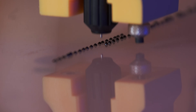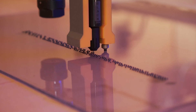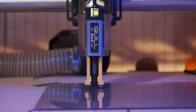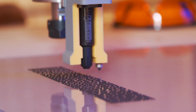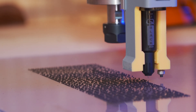Next up is the Mona Lisa — the main reason I personally wanted to get this, to show off the weird capabilities. I think it's easy to see it's very good at printing durable, ADA compliant Braille, but what I saw was pointillism: creating artwork using small dots so that from far away you see an image, and the closer you get it goes away. I first turned the Mona Lisa image into Braille using a free online tool, then turned that Braille image into vectors using Carveco and assigned my drilling paths. I designed it to stay under 5,000 dots and ended up exactly at 4,835. I loaded in my only black resin cartridge and let it run.